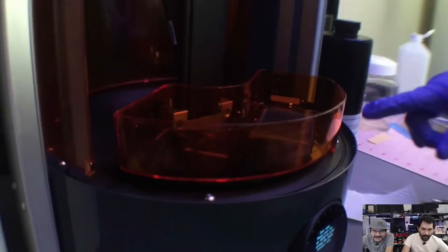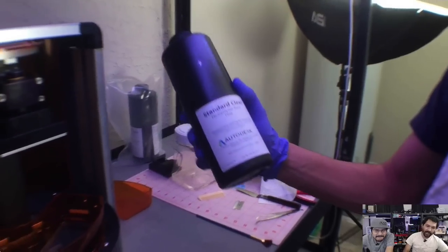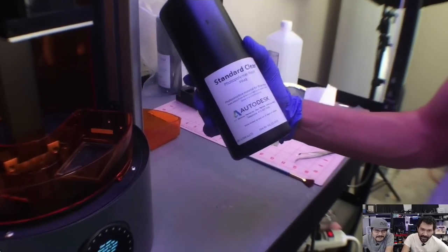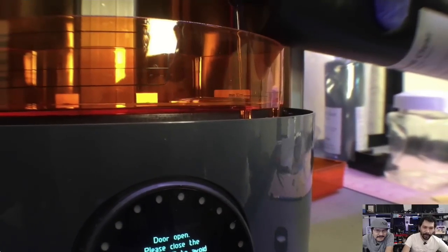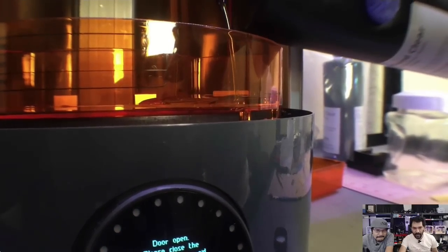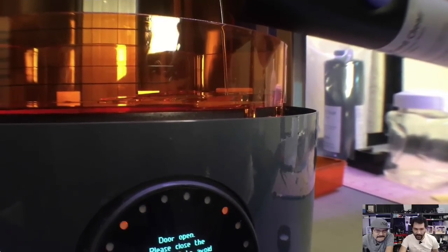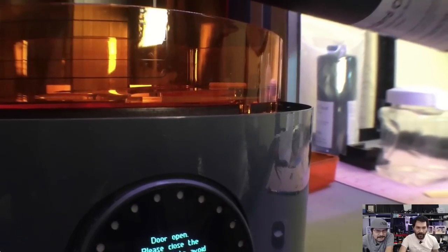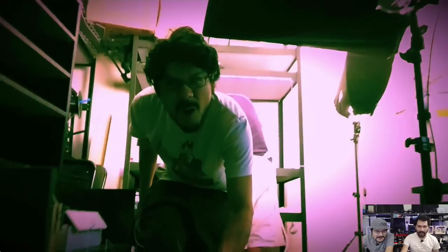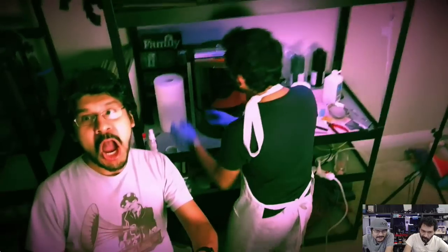So this is the new tray that we're putting in here, and it just easily slides in. The resin that we're using is just a standard clear photopolymer. There's a PR48, that's in the labels there. There are little minimum and maximum guidelines for how to pour in, and it's pretty viscous. It's like honey. We've noticed that it performs a little bit better when it's heated up a little bit.